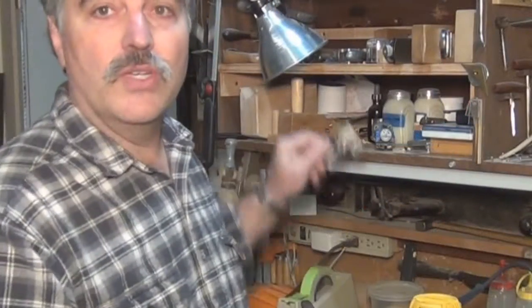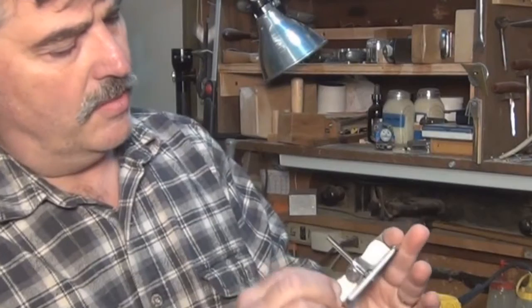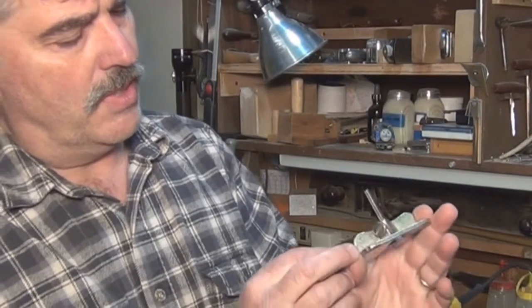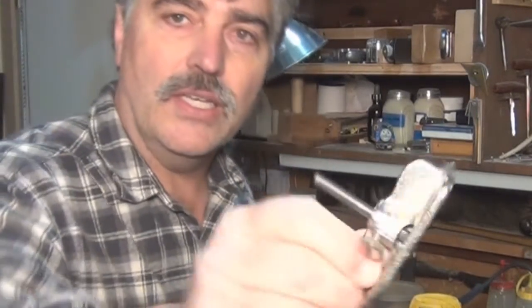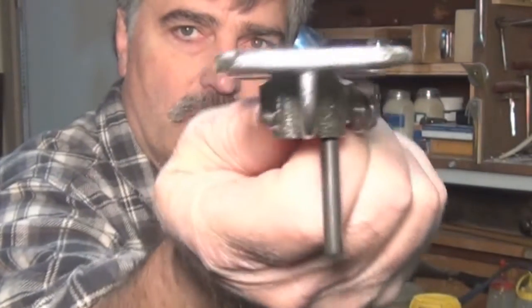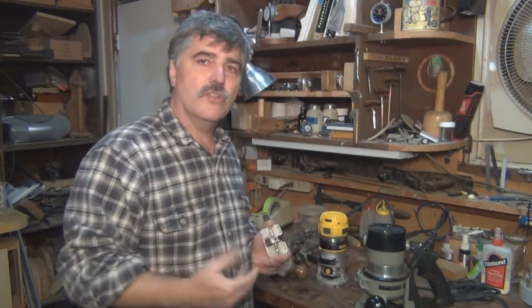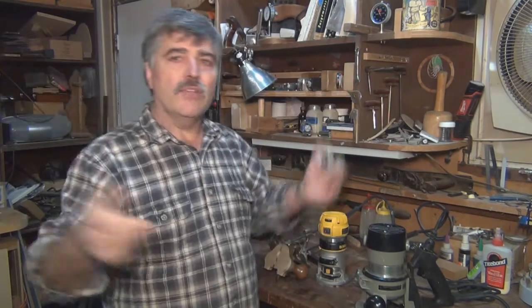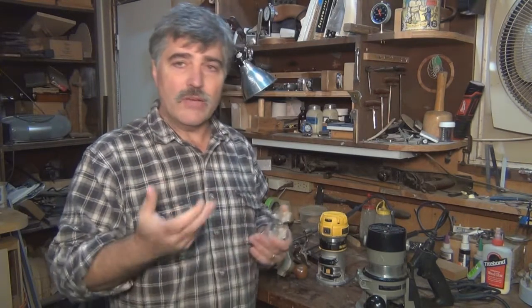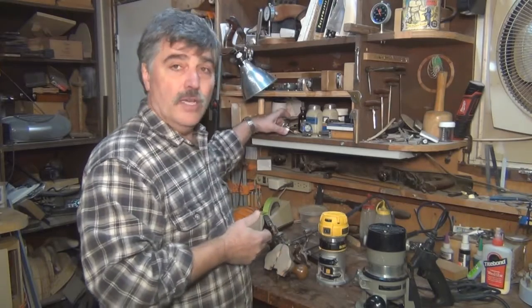I also have this small one here that I use as well — a modern day purchase, not an antique. Model 271 by Stanley. Just a small chisel. It takes a little bit of setup to get it right, but I'll use that for lock sets and things in interior spaces when I don't want to have all the dust and commotion of a router. Nice little tool for getting a consistent depth of cut.